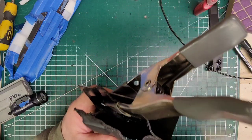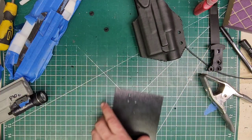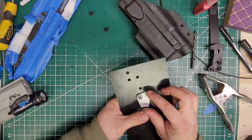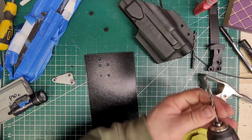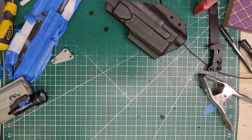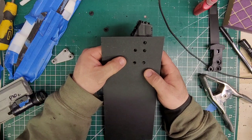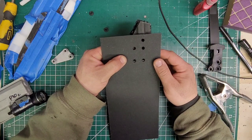Take that, get at least one — that's all you need is that one. Drill that hole, swap to this guy, square it up, start that hole. Clean up your new holes and then go ahead and check it. I might have to open up these ones a little bit — but perfect.